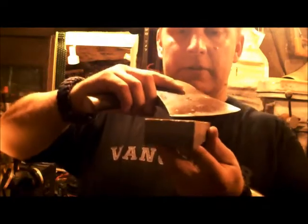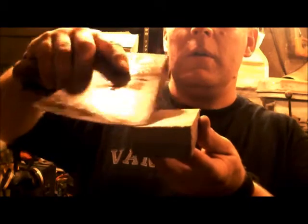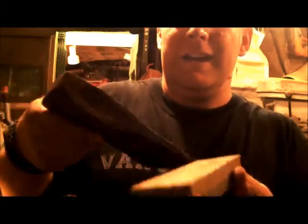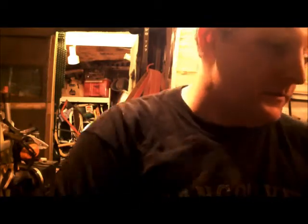I was on like that and just going. Like that. And then back the other way. And the reason to go back the other way, if you can imagine the steel as you've scraped it off, you'll get a little burr kick over onto the blind side. So what you're actually doing is, as the steel kicks over, you want to nap it back the other way and gradually work it away till there's no burr left, or you strop it off.